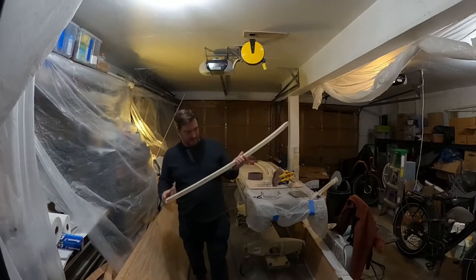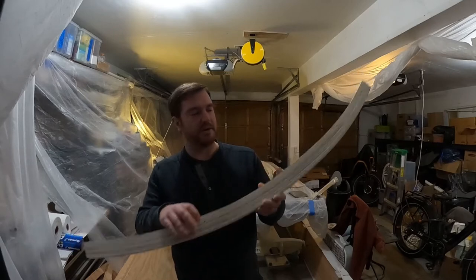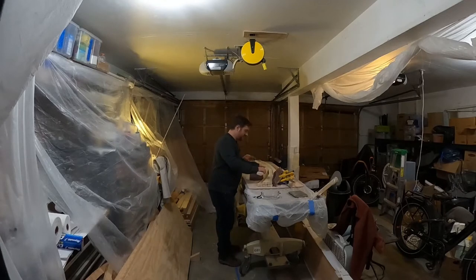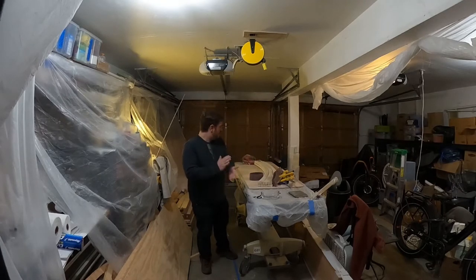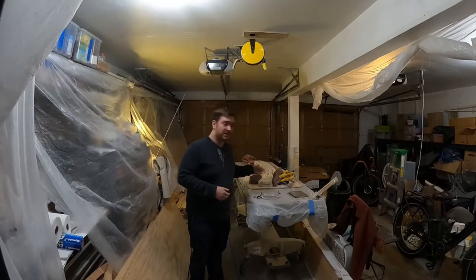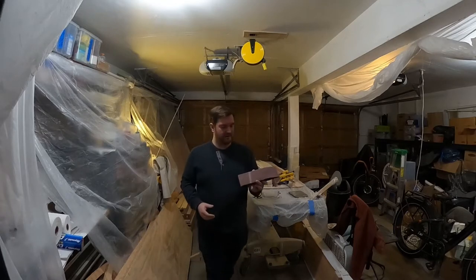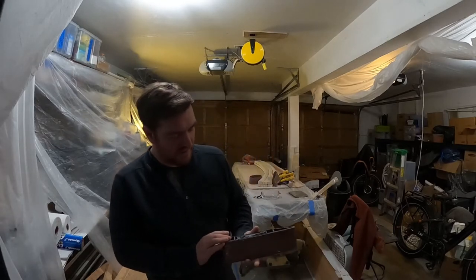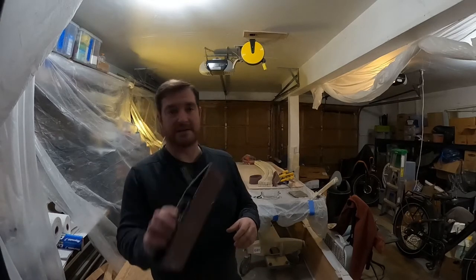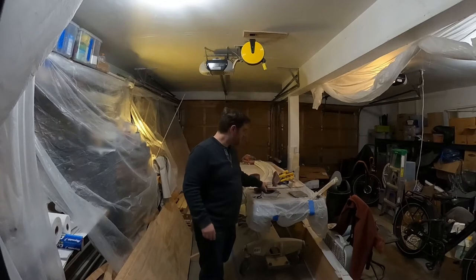This one here is able to clean up nicely. I'm using a belt sander with 36 to 40 grit — it's a 3x18 belt sander — which works really great to take those down, just be a little careful. And this little tool, the Miles Craft sander, which uses 3x21 belts so I can't just swap them, is an excellent hand tool. I'm using 36 grit on the belt sander and 40 grit on the Miles Craft. It does pretty good work.